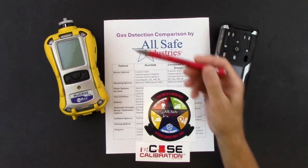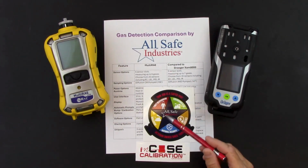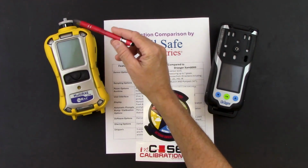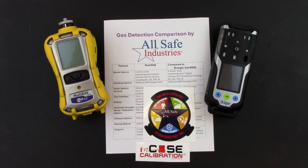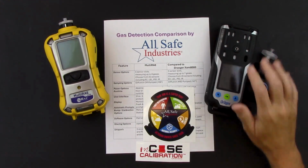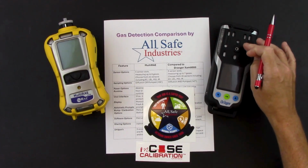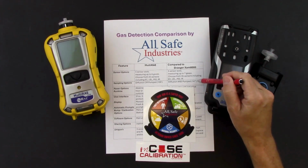This one has a pump, as you can see. All the other versions of the MultiRAE have the built-in sampling pump, and we can draw from 100 feet away through tubing we would attach to our inlet port. For the Draeger, it's a diffusion and a pumped instrument. And so we would use Draeger's pump cap attached to the front of the meter that would activate the built-in sample draw pump. So this allows this one instrument to be both diffusion and pumped, and when you're running the pump, you can pull through 147 feet of tubing.